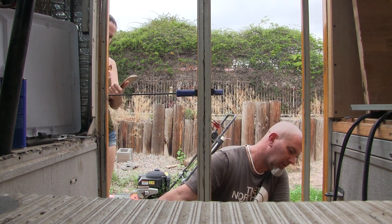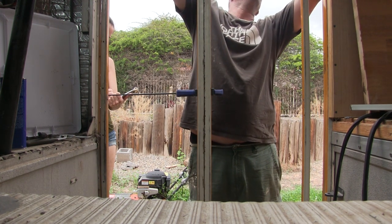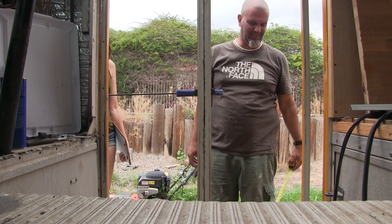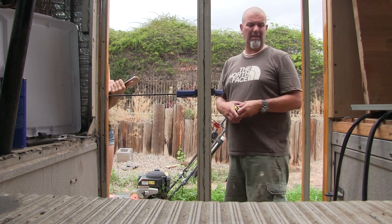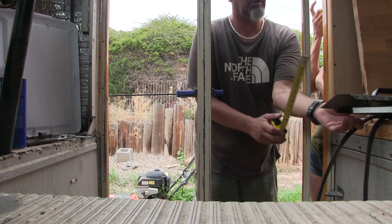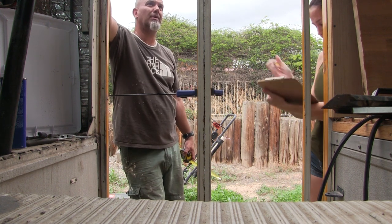So the width of this is 33 13/16. Up here, it's 34 1/4. 34 1/4? Yeah. It's way off. So we're gonna have to jimmy this side. So we need a 2-inch piece of metal right here by, say, 7 feet. 1-inch strap, about 3 feet of it. We might even have that. 4-inch by 2-inch tubing if he's got it. And 2-inch strap, 7 feet.